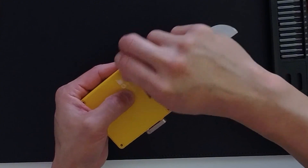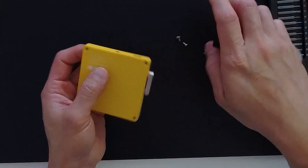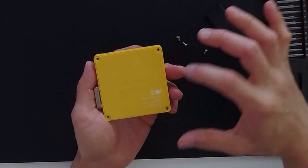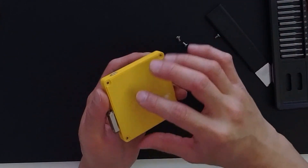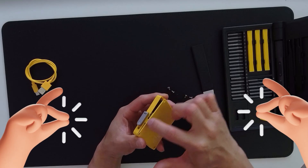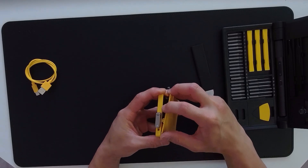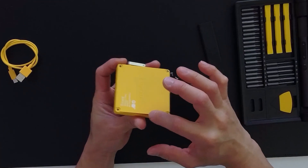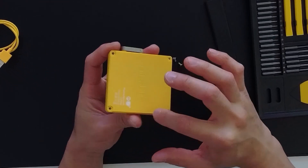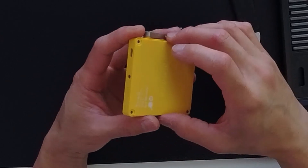My quick observation here is that the front cover plate goes over the side so you don't necessarily see the parting line — the back cover is inset into the front cover case. In addition to the screws, you also have snaps along the flats of each side. This is because you have fasteners in four corners and you want to manage and maintain the gap along the flat sides and prevent separation.